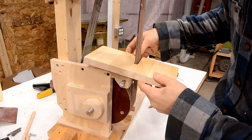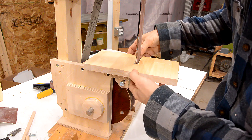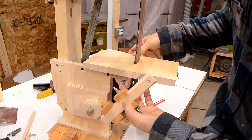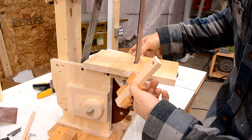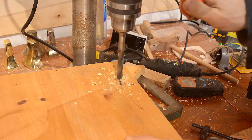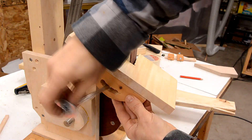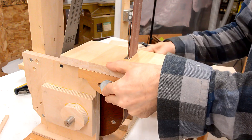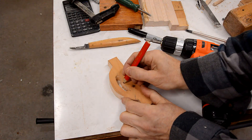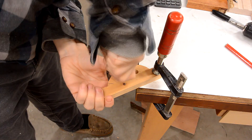The table tilts around the platen like so, and I figure it will attach with a piece that has a slot on the bottom and a bolt that goes through for locking it. The center of rotation for this table should probably be about the top of the table right about here. With respect to the table, this bolt traces an arc that goes something like this. I think I need to carve out a little bit more here so the table can drop down a bit as it's tilted.